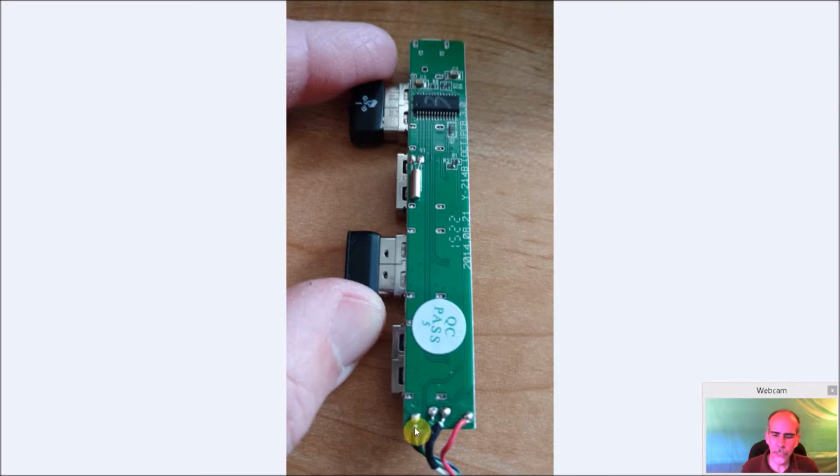So you can see here on the board the 4 wires needed for USB. The red is going to be your power. The white and green are your data transmitting, and then the black is your ground. Then we have 4 ports. And basically what I'm going to do is remove this particular header off of here, and I'm going to solder the USB sound directly onto it.